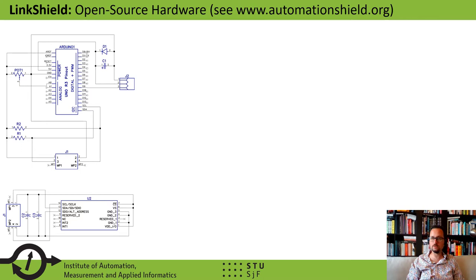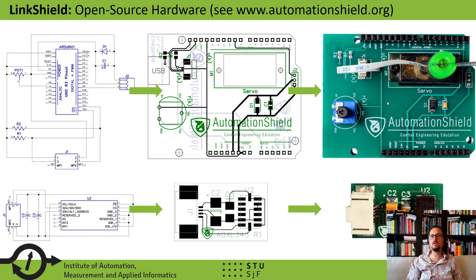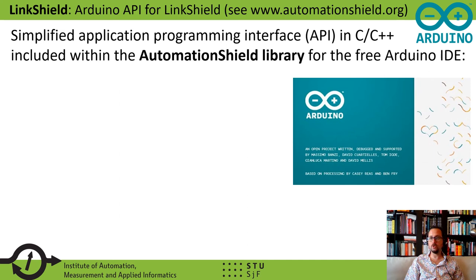As I have mentioned earlier, every device within the AutomationShield initiative is open source. This means that anyone can download the electronic schematic files for the Link Shield along with the printed circuit board layouts. These layouts can be sent to overseas manufacturers and can be made ready to order in a couple of days for very little money, and then can be hand soldered to create a final finished device. The bill of materials adds up to a material price of just under 22 euros. All the components can be easily bought and sourced anywhere in the world. The price excludes consumables, labor, and the Arduino board.